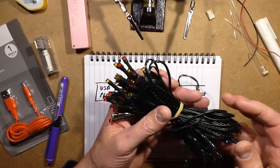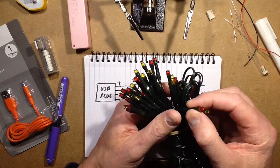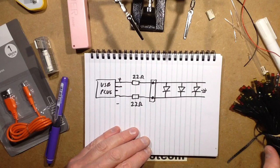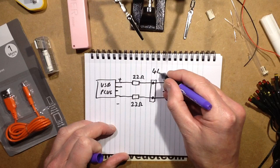It's really just a parallel array of LEDs. In this case they're the nice ones with the phosphor — blue chips, green chips, and then yellow and red made from a blue chip making a red or yellow phosphor glow. This means they've all got a pretty much identical forward voltage, which means they'll all glow at roughly the same brightness. The reason for choosing 22 ohms — combined total 44 ohms.